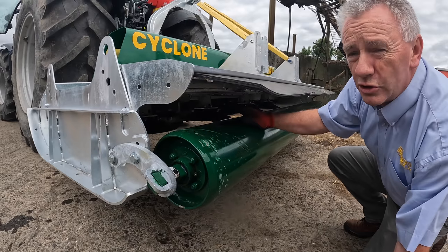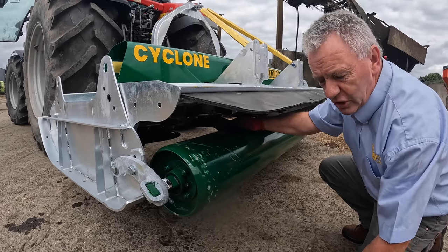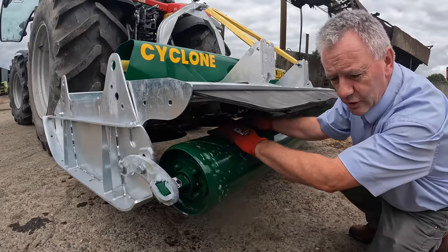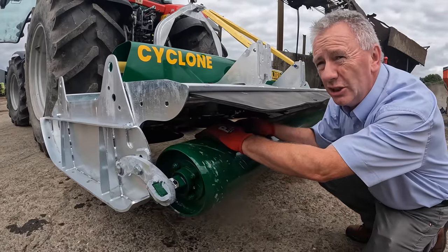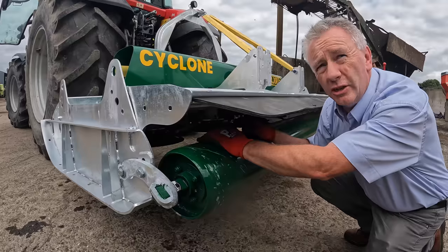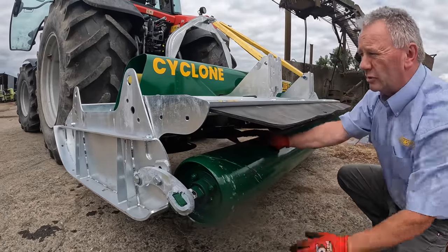Compared to say flail mowers and a lot of the other machines people compare them to, where your flails cut very tight and they're not very good in a paddock. Yes. They'll just tear the grass. You're looking at a ground speed here in heavy going, you'd work away at about 5 kilometres an hour. Yes. Right up to about maybe 10 then in a paddock. It wouldn't be too bad at 10 though. You'll knock a lot of ground out in a day.